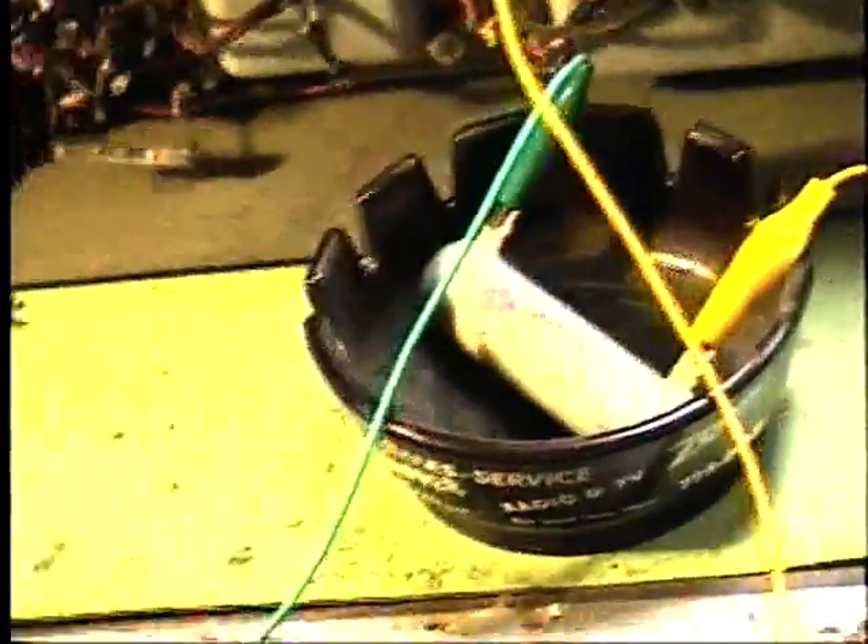This is designed for use with a field coil woofer. The Leslie actually has a field coil woofer in it, so we've got a resistor here that's substituting in place of the field coil to keep the voltage in the circuit at the proper value. I've just got it hooked up with some alligator clip leads here.